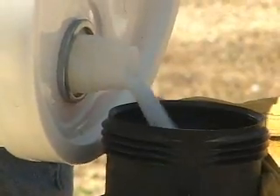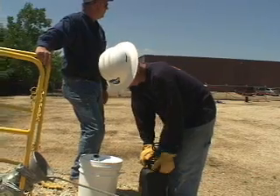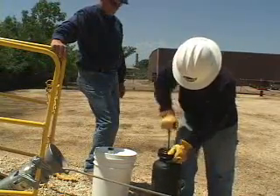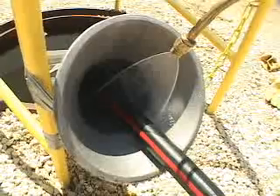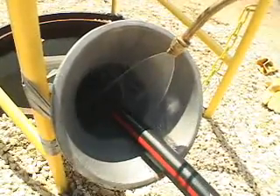It is easy to fill the IS-3 tank from the pour spout on the pail of Spy Lubricant. Once it is full, close the sprayer, then pump about 30 times to build the right starting pressure head. Simply aim the wand at the cable and spray the lubricant by depressing the handle.